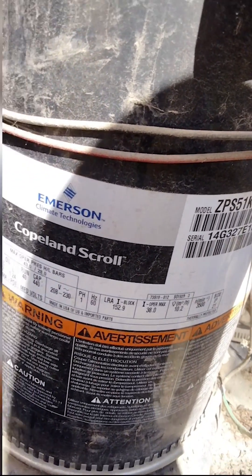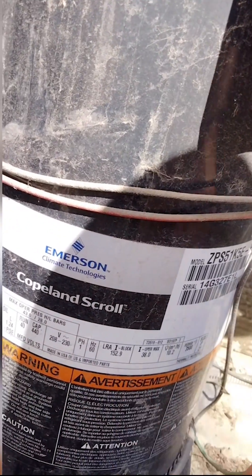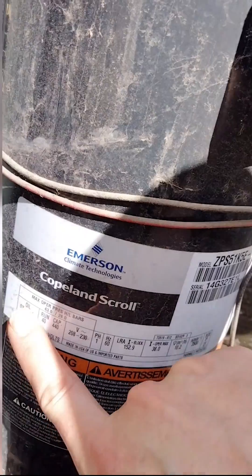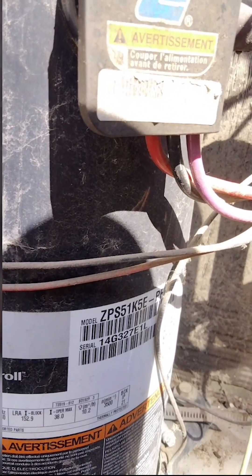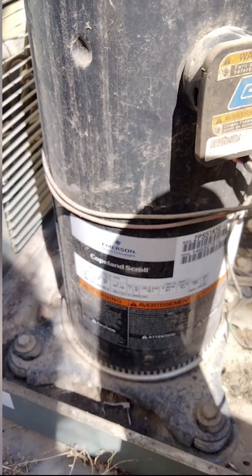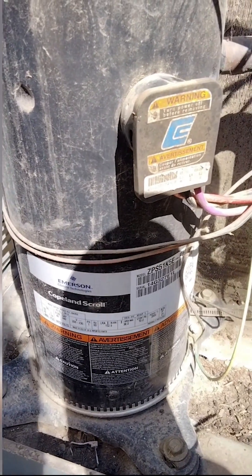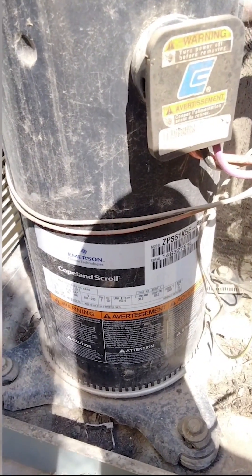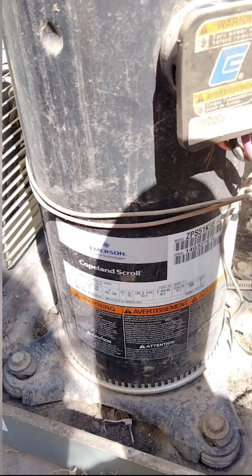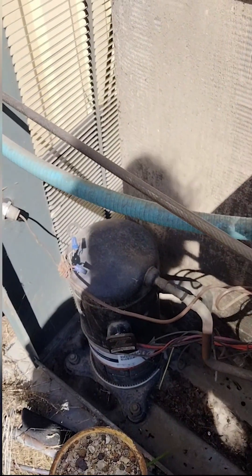You can check the amp draw on the unit yourself up until then — it'll show you on the nameplate how many amps it should be pulling; look for FLA, which stands for full load amps. Make sure it's not pulling over that amp draw. With most compressors, unless you have a hard start or soft start kit, it's going to kick on and pull a lot of amps up front, then you should see that number start to come down. It should never over-amp for any extended period. It is always going to pull more on startup, especially if you don't have a compressor saver or soft start kit.